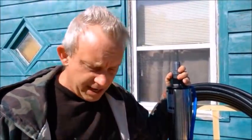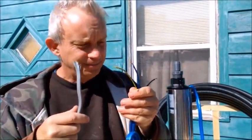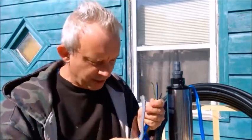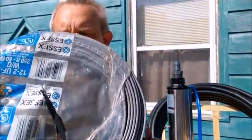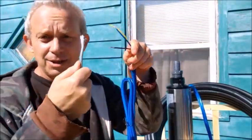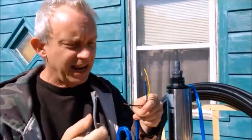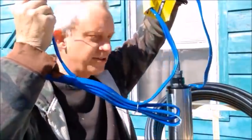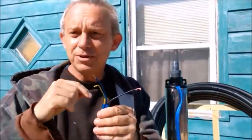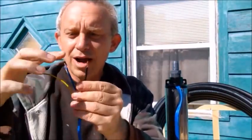What I'm going to do today is add the wire I need to add — 250 feet of wire, a whole roll right here. I'm going to wire this up today and show you how to do that. The reason I'm doing the wiring today is because when this goes inside the water, there's only about 10 feet of wire that comes attached to the pump. If I put this down into the well, the wiring could actually ground itself out.